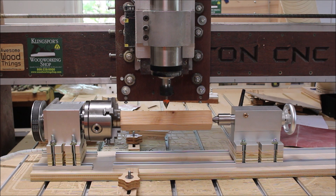I don't really need the spacers for this small a piece, but I wanted to go ahead and see how hard it was going to be to line up, and it was a little difficult — I had to fiddle around a little bit. You can see I've got a 60-degree V-bit in there to help me get stuff lined up, but in the end it came out okay.